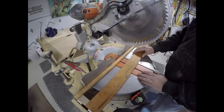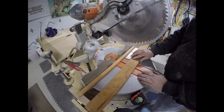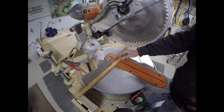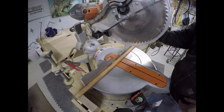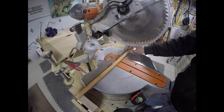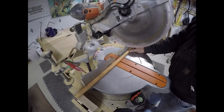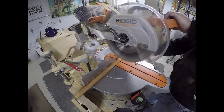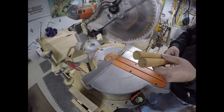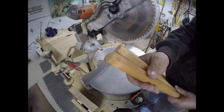I'm at the Ridgid sliding compound miter saw and I laid out the center line of the long rod and the long base — I'm going to cut each of these in half. The nice thing about this saw is it has a laser light so I can line this up the best I can by eye, and when I turn on the saw the laser line will show a red line so I can do my final adjustment. Keeping my fingers out of the way — it's going to get loud. The saw splintered the wood a little bit, so I'll take both ends to the belt sander and smooth that over.